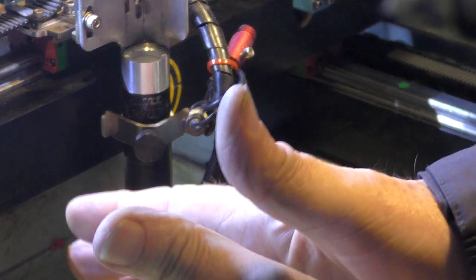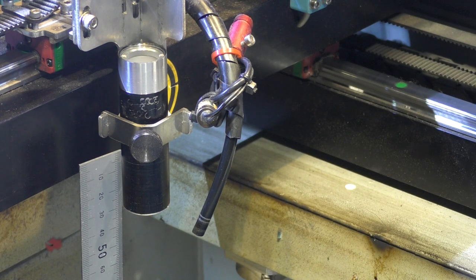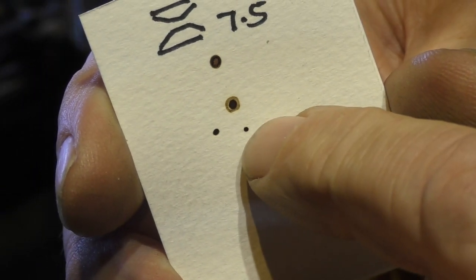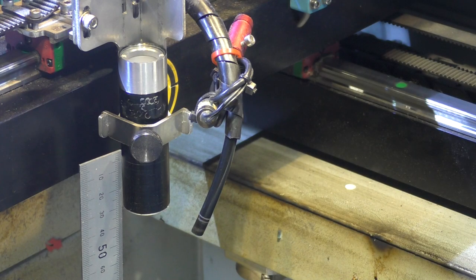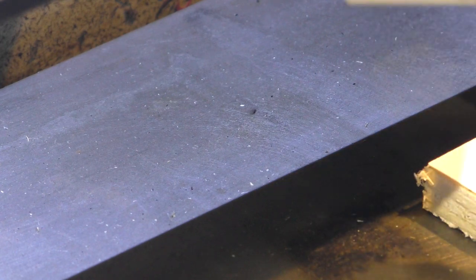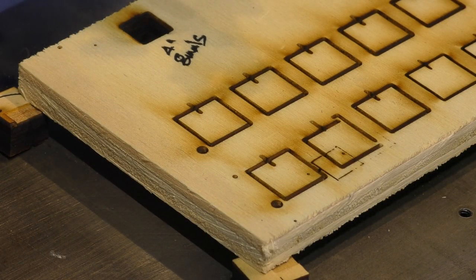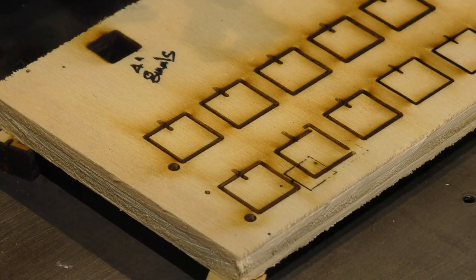Now I've got my two lenses curved side to curved side. The prediction was that the focal length would be somewhere in the region of about 70 millimeters. That small reference lens there is about a hundred millimeters, so from nine inches, putting two lenses together has converted this into about a four-inch lens for distance — probably about 107 millimeters.